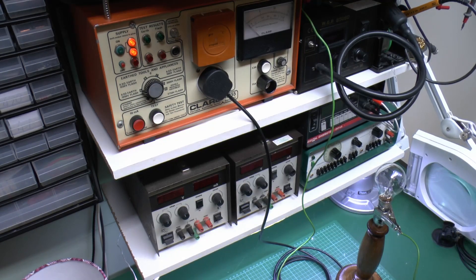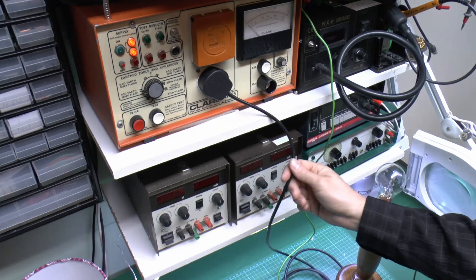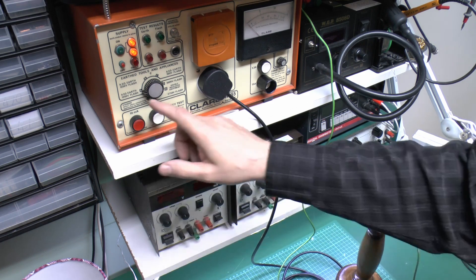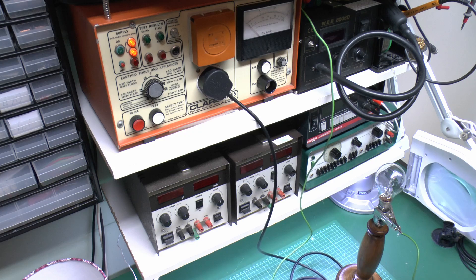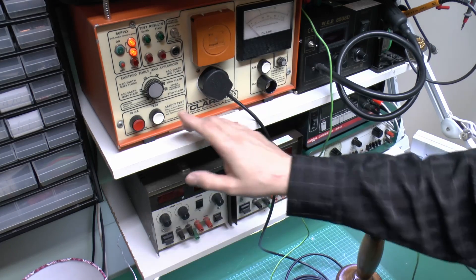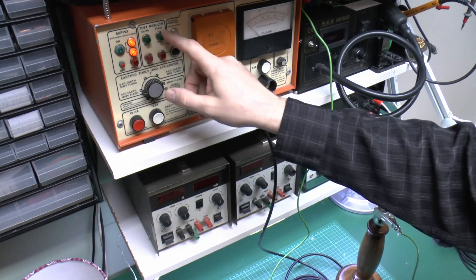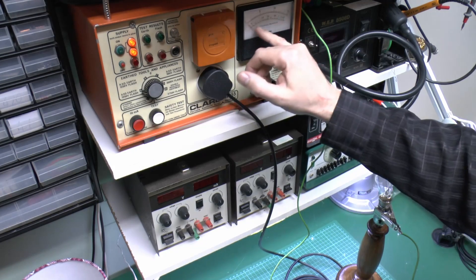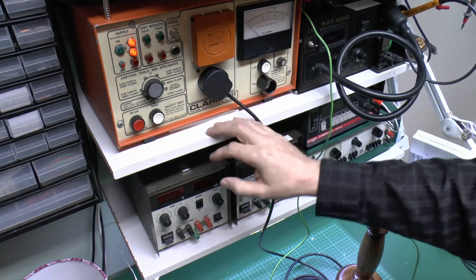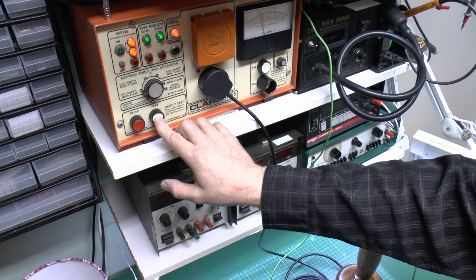This is effectively a new item which hasn't been tested before. The disadvantage of using 1250 volts all the time is that applying it to a cable repeatedly can eventually degrade it, but obviously for a once-only test when it's new that's not a problem. We're using 0.1 ohms because this is a very short item with only a couple of metres in total - you might use the 0.5 ohm setting for say a 20 metre extension lead, but that's not applicable here. Then all we need to do is press the test button, and we should see the green lights for continuity and the flash test, plus the continuity resistance on the lower scale - looking for something less than 0.1 ohms. And there we go - both green lights are on, and it's well below 0.1 ohms.